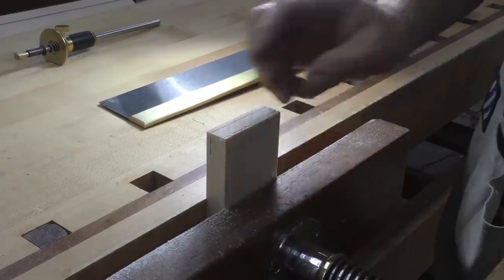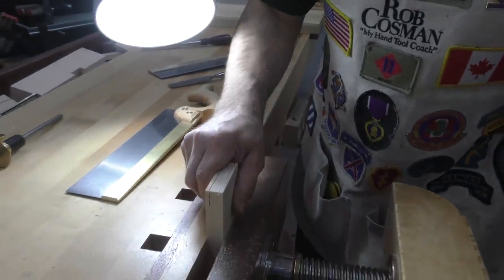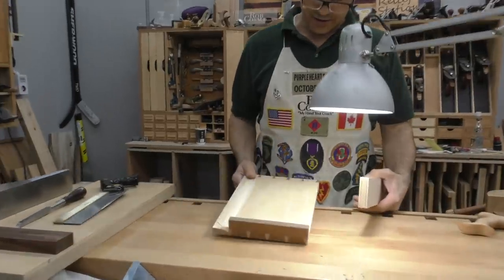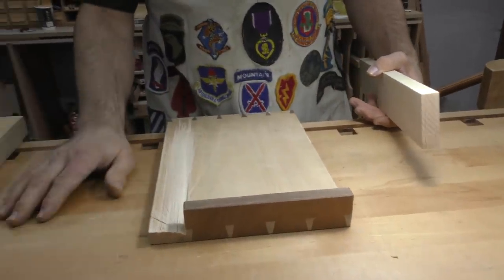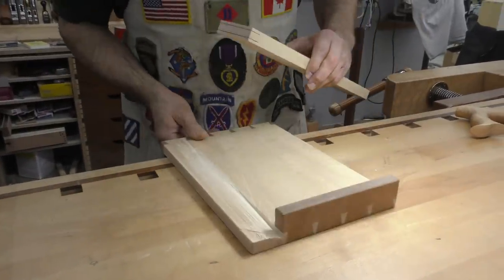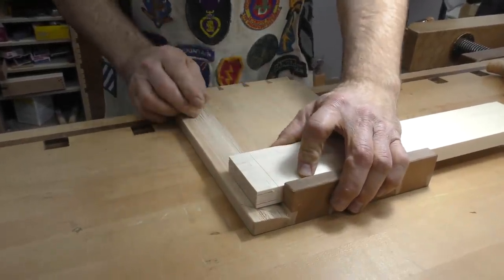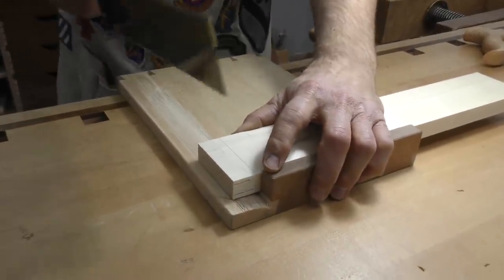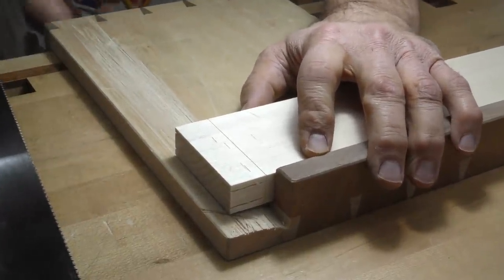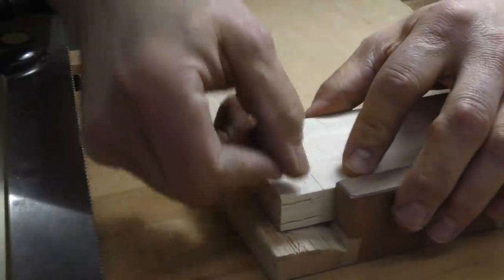Now you take both cuts all the way to the bottom, and then your next task is going to be to remove this cheek. I am going to finish those cuts and then we will go over to the shooting board and I will show you that. Now this is my bench hook — all it is is a device designed to preserve your bench so that you are not sawing down into it. It has a cleat on the front that catches the front edge of your bench, and a cleat on the back. You simply squeeze the board against the cleat so it is nice and solid. It also frees up my finger to help get that saw cut started. And of course with a western style saw that cuts on the push stroke, the cleat supports that.